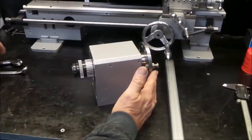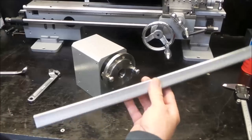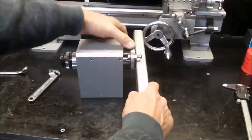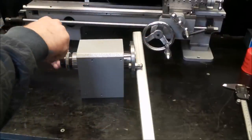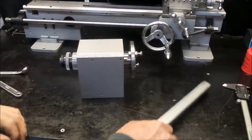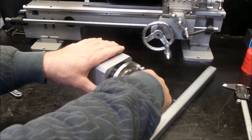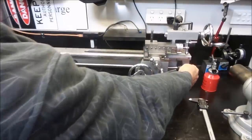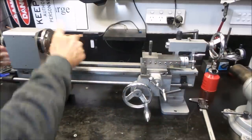As I mentioned when I pulled it apart, I don't have two of these small C-spanners, so I've just put a couple of bolts through the chuck, got a piece of 25x25 or 20x20 square stock, set that on the bench, turned the chuck around — that locks it up. Put the C-spanner on and crank it home. That's all there is to that — that'll be plenty tight enough, as long as the crappy lock nut holds on, which I'm sure it will. And that's all ready to go for now.